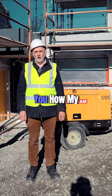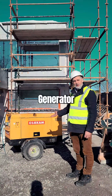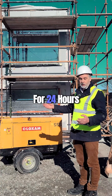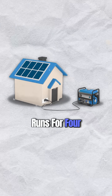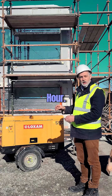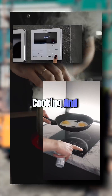Hi, I'm Joe and I'm going to explain how my house is running in off-grid mode during the construction phase. We end up running a generator during the winter months here, and to stop the generator running 24 hours a day, it runs for four hours and charges the batteries in our attic at four kilowatts an hour, giving us 16 kilowatt hours for use during the day for heating, cooking, and everything like that.